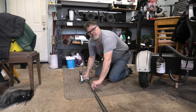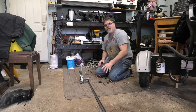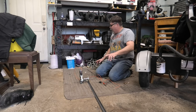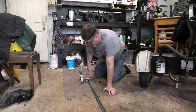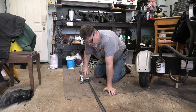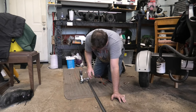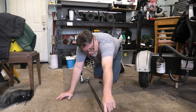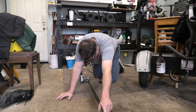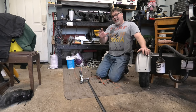This is going to go underneath the bed against this side, so it's not really taking up much room. I'll put a little box around it. I'm going to have another piece of steel with a wheel on it and a pulley here. It's going to have a cable that runs from this, around the pulley, back to the pulley, and then back to this again, so it doesn't put a bunch of stress on here and it can lift a lot more. That's my theory.